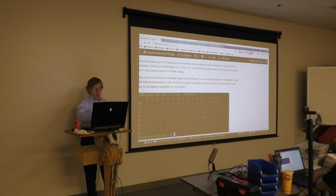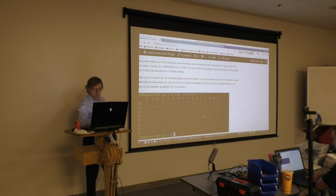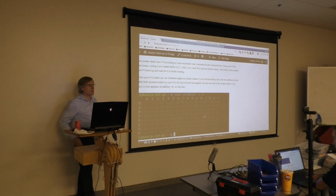I actually counted on it. I'm pretty sure that if you count up the rows and columns, it comes up to 127. So that leaves us space for every possible unique address. Oh, here it is. The 4 is from the 40 in the row header, and the C is from the column header. Put those together and it's 4C. So if you're one to the left, that would be 4B.